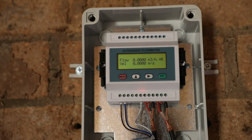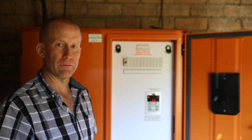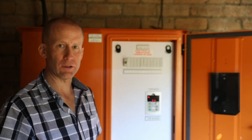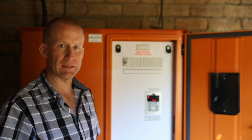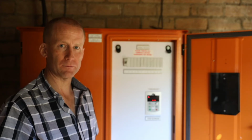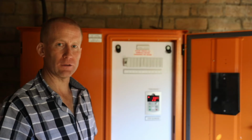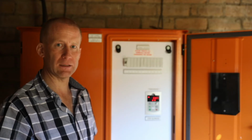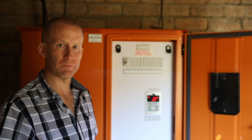You must ensure that the unit has gone back to menu 0, and then you know that it has saved its parameters into memory. The Pivot Optimizer will work with any brand of VSD. The VSD must be set up according to the parameters of the motor so that the VSD will trip if the motor exceeds its allowable ranges. The VSD must then be set up to receive an external run command from the Pivot Optimizer as well as an external speed command from the Pivot Optimizer.